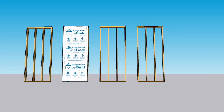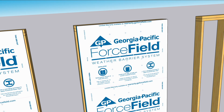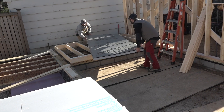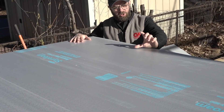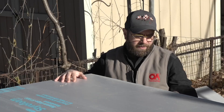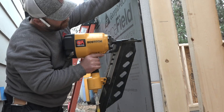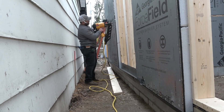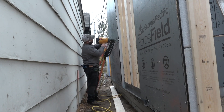There are four types of wall in this tiny little shed. The first wall type is a simple 2x6 wall framed 16 inches on center with a layer of Force Field sheathing on the outside — an uninsulated shed wall that doesn't face a property line. The second wall type is a variation of the first with 2x6 framing and a layer of Force Field on the outside, but on this wall type we sandwich 2 inches of styrofoam between the studs and the sheathing, making insulated wall panels on site. We've got DuPont's Zero GWP Styrofoam, 2 inches for R10, glued using Huber subfloor adhesive to a 7/16ths OSB sheet from Georgia Pacific with their Force Field coating. The nail base is on the outside — framing, foam, then a 7/16ths nail base — and pretty much every cladding out there can be attached to a 7/16ths wall sheathing.